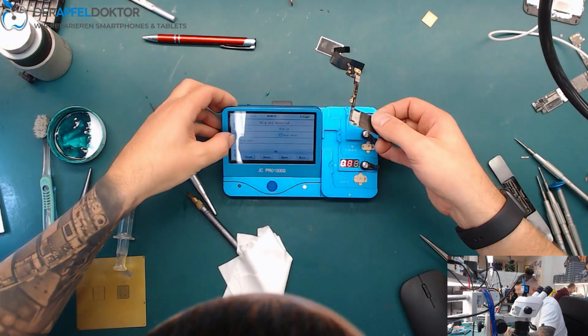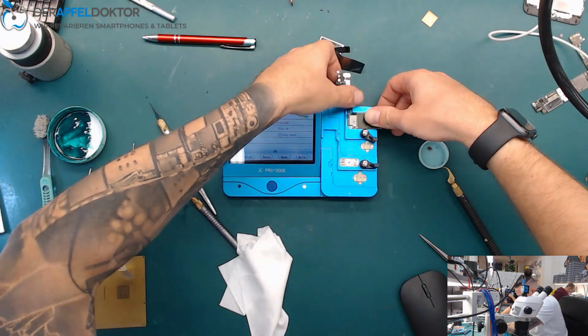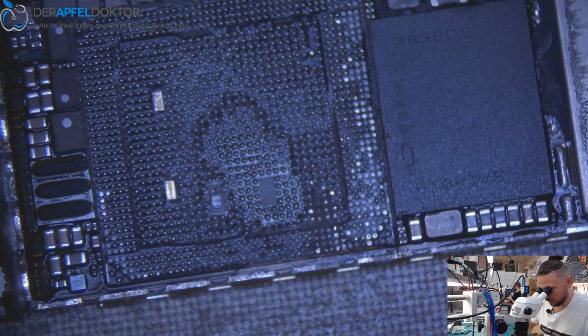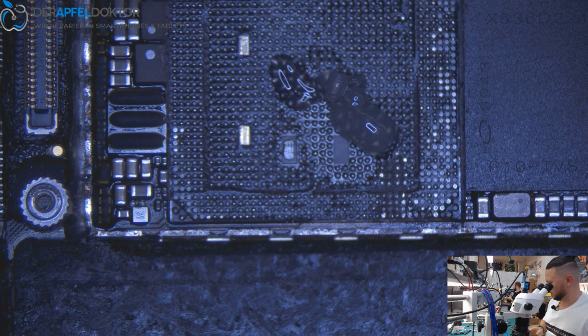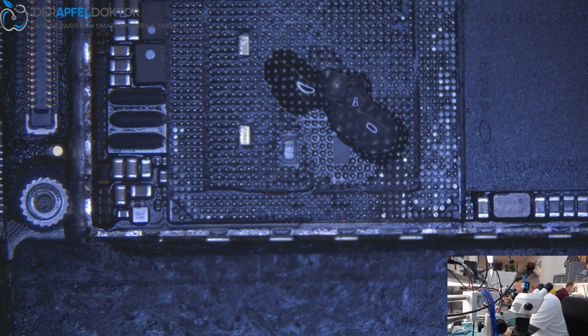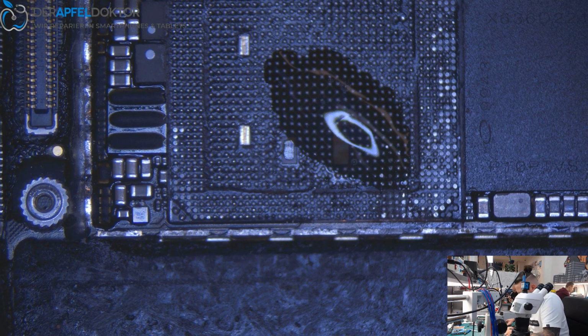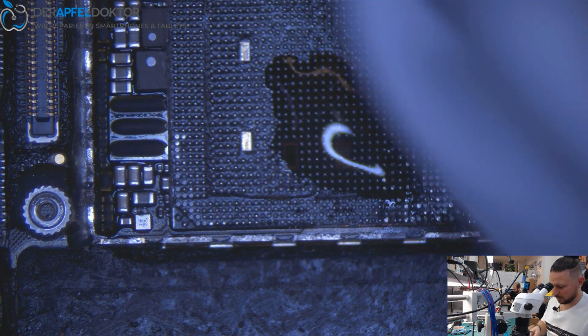And so, logic, okay, it's not detected, it's no problem, I just clean. Just clean the board one time. Fast. I try to get out data here, but it says the same. Okay, so that I wanted to test before, because when it doesn't recognize the EEPROM here, it's not necessary for me to clean here, because I just swap the EEPROM. Makes more sense for me.